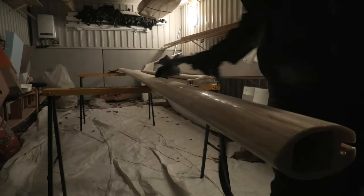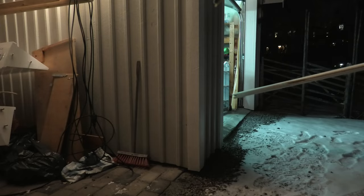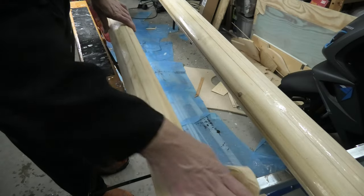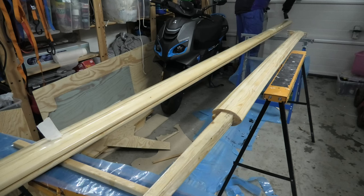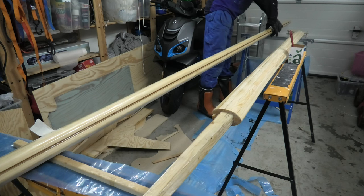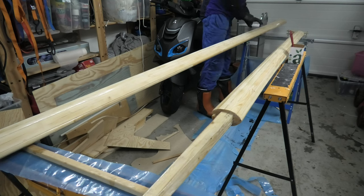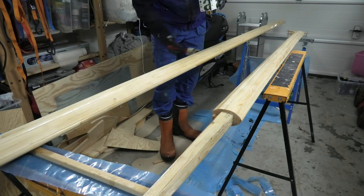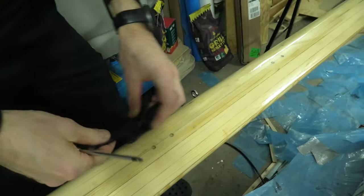Vacuuming off most of the dust outside before moving inside for the final layer. A sticky cloth removes most of any dust left. The final layer is applied, and I rotate the mast as each side gets a coat. As this is the final coat, I use less varnish in the brush with larger strokes to avoid curtains and unevenness. The last step is to attach cleats.